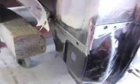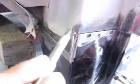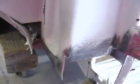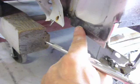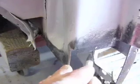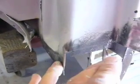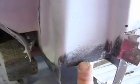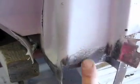Here we have the outer hinge pockets where I scribed right here. So I scribed my lines, and then I decided to flange some areas. Right here. And right here. So, my original scribe lines are right here. I wanted to flange it, so I measured a half inch down here and a half inch down here. Then I took my flange tool and stepped it. And in doing that, my overlapping panel will lay flush with this right here.